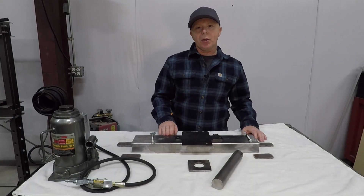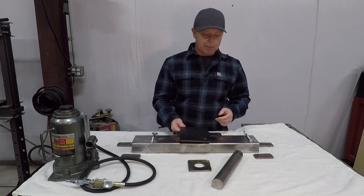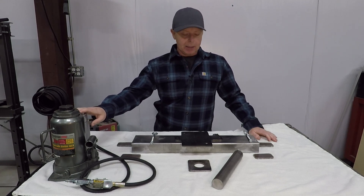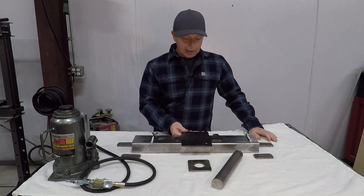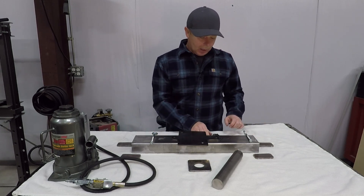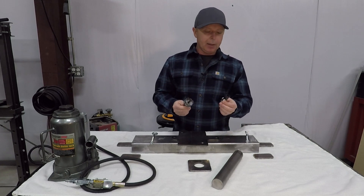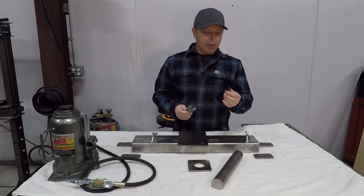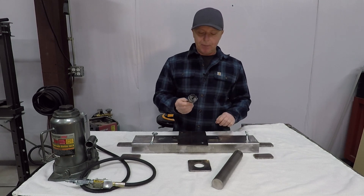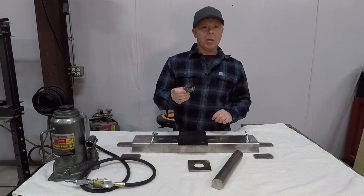I've drilled a few holes in our new cross member — a couple of holes for our eye bolts, as well as a couple of holes for the new base plate for the jack. I wanted to make this base plate removable in case I ever have an issue with this jack and have to replace it, and if the footprint is different I want to simply be able to replace it. Lastly, we'll need to drill a hole in the center of this cross member for our inch and 5 eighths solid stock. I started buying these carbide tip hole saws on Amazon — they seem to be more accurate than the old style. The old ones break teeth off very easily and the hole always seems to be a little bigger than it should be. These carbide tip hole saws do a really good job; it's a clean cut and much more accurate in my experience.